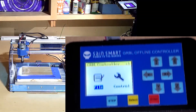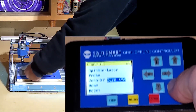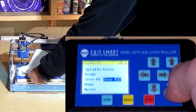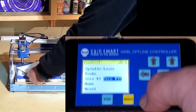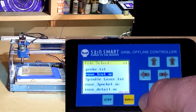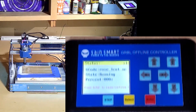Now we're switching - we switched out the three millimeter for a one millimeter end mill. Again, we just go back and set the zero XYZ. It is really easy using the controller. It's a great way - the paper method is very simple. Once it catches, I go down 0.1 twice after it catches and get a very, very good clean cut. It cuts down just to the back paper backing. Sometimes it busts through it just a little bit, but it doesn't really have anything there.